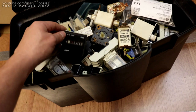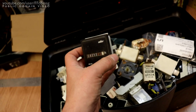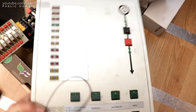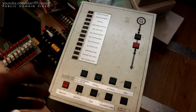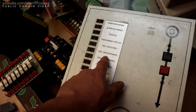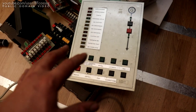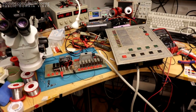Aside from this box of goodies with some questionable hour meters, I have these panels - these are fancy automatic switchover controllers. These take care of completely automatic backup diesel operation. It's got basically everything you'd want: undervoltage protection, overcurrent protection, oil pressure monitoring, automatic starting, emergency stop functionality. Now this one is supposedly broken - they tried to fix it and it didn't work. However, we have another one.